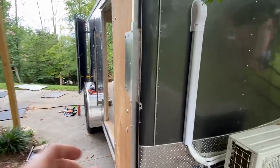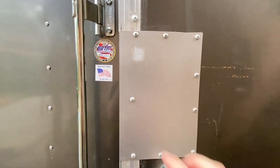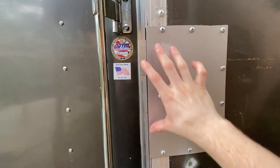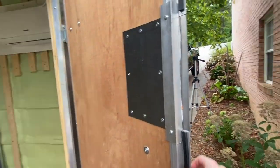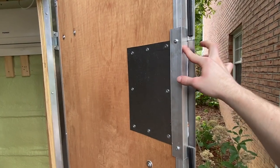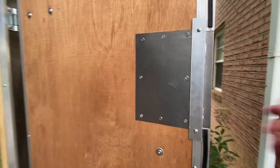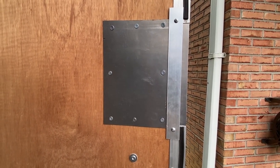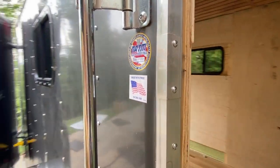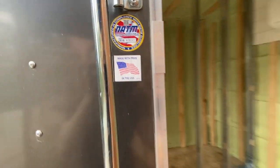Let me show you what I did with the door since I screwed it all up. I covered the holes with a steel plate on the front, keeping a little overhang because I cut out a notch trying to make the door handle work. On the inside, I took a piece of aluminum angle, cut it to size, ran it through the table saw to make it shorter — it's still a hair short so I'll put some silicone in there. On the back there's another steel plate covering those holes, so when I install the actual door handle it'll go right through the steel plate for extra security. On the side where I notched out a hole, I cut another piece of leftover aluminum and covered the edge. I think it looks pretty good, all things considered — glad to be done with this stupid project.